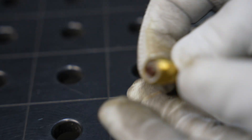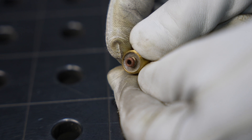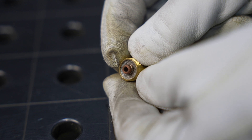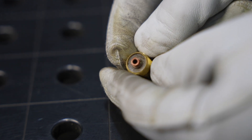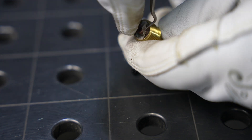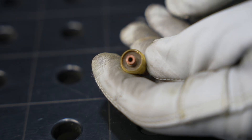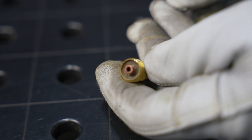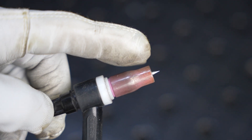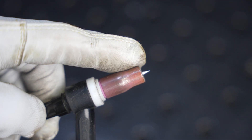The reason I prefer a standard collet body over a gas lens for aluminum is simple: I don't want to clean out the gas lens. Here's a gas lens I've used for some aluminum — notice the aluminum deposits on that screen. Over time that interrupts the gas flow, and your arc will wander. You can pull off a layer with a pick and get more life out of it, but I don't see a lot of advantage on aluminum. With a small cup, controlling where the argon flows etches less material off around the aluminum weld puddle on AC.